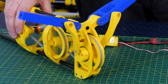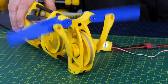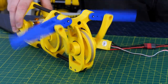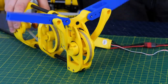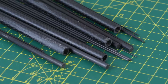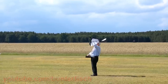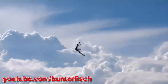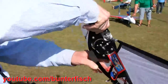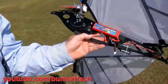I've added the levers for the wings which have multiple holes so I can change the leverage angle. We're going to put carbon fibre rods in these so they're quite long - there's somewhere to shove the rod in so it doesn't just snap the plastic. I bought a selection of carbon fibre components this time including the 8.5mm tubes and also some 4mm, 2mm, and 1mm rods. Because I don't really know what I'm doing, I thought I'd copy someone else. I found a really good looking ornithopter on YouTube which flies really well - it's mostly made from carbon fibre with some metal components around the wing levers, and it's carrying what looks like a 1600mAh battery.